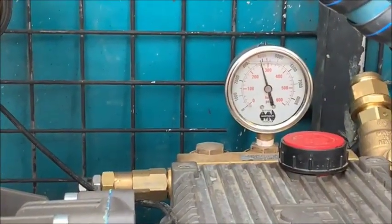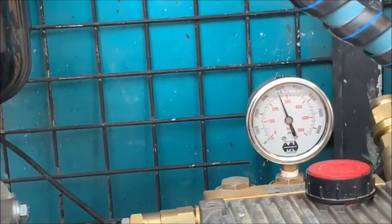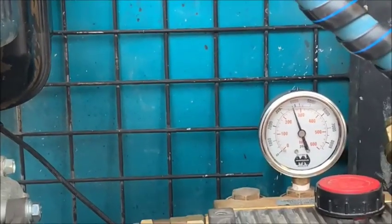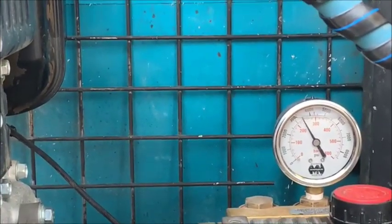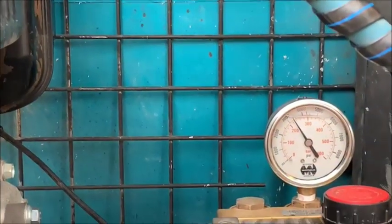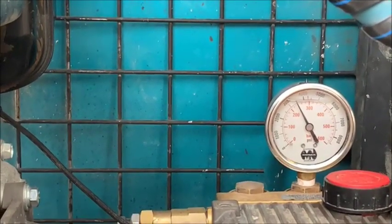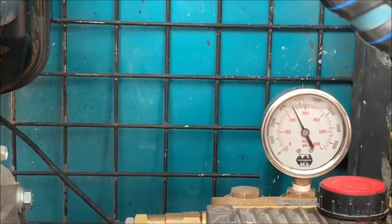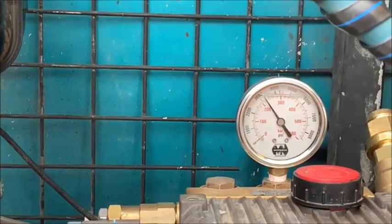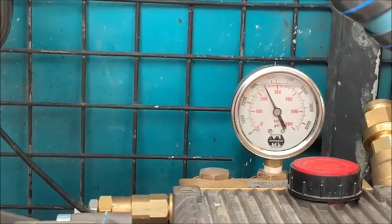As you can see we hit very close to 4000 PSI, but as the water actually depletes and goes down we then start getting a big issue again — the pressure drops and fluctuates on the pressure gauge, goes all over the shop and really struggles. As the water goes down it struggles.